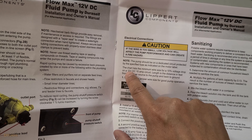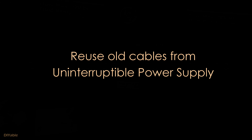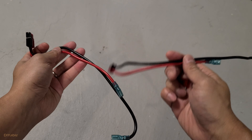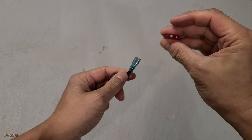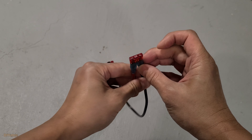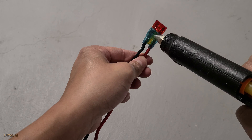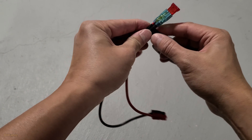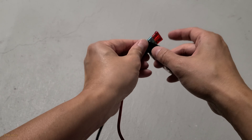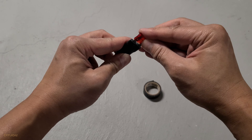Now let's take a look at the user manual. At 12 volts DC, you want to install a 10-amp fuse to protect the circuit. Here is a useful DIY tip: for an automotive fuse, you don't actually need to buy any fuse holder. I am reusing an old cable from a UPS — I always take old electronic appliances apart and find useful parts for the future. This is the 10-amp fuse; it fits right into the connector. To make it function like a fuse holder, I am applying some hot glue so it will stay in place. Then wrap it with some tape and we are almost there. This DIY fuse holder can save you two bucks. You can remove the fuse just like the one you buy from the store.